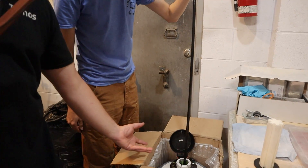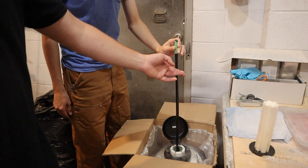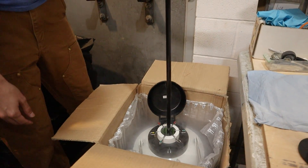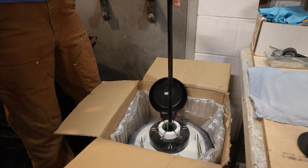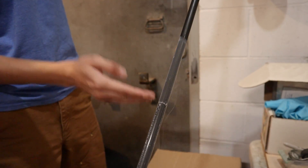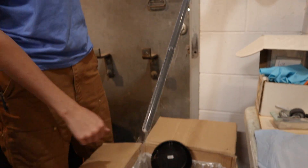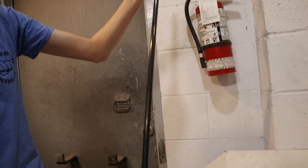You don't want to stick your hand in there. We've got a depth gauge because there's essentially always gas coming off of it — it's very hard to see inside. We use a plastic gauge, which is key, because plastic won't conduct the temperature up. When you pull it out you can see exactly where the liquid nitrogen level is — it's boiling pretty intensely just from the ambient heat of the room. You can see it start to crystallize at the top — that's our liquid level. We've got two lines scribed: this is the very top of the container, and this is basically the critical level where it needs to be refilled so the blades are submerged. We tried an aluminum gauge and immediately realized that was a bad idea — the entire thing got covered in frost.